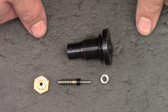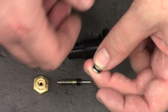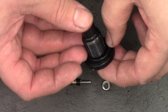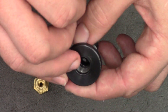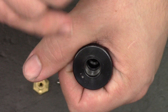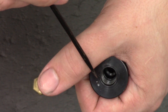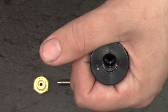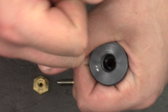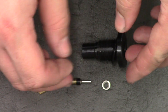I'm happy these O-rings don't need changing, however if you did want to change them it's quite simple. This one can be cut out using a sharp scalpel, obviously being careful not to mark any of the faces. The one around the end here can just be pulled off. The only tricky one is the one inside here, which is very similar to the one found in the body of the rifle for the regulator. Get a sharp pointy thing in the end there, pierce one side of the O-ring and lever it out. Then the next one can be pushed in, one side started, then go around the outside just poking it down into the O-ring seat.